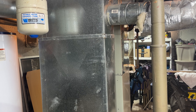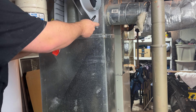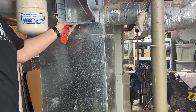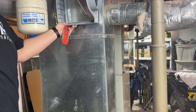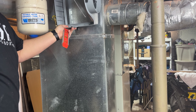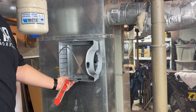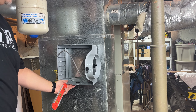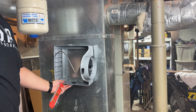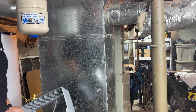We want to determine the placement of this unit. I was debating putting it up high, but knowing that the thermostat has to go at least six inches above it roughly, it's going to be borderline. And I can't put it on the joist, so it looks like I'm going to have to put it at least at this height here. We'll get out our template and place it on there.